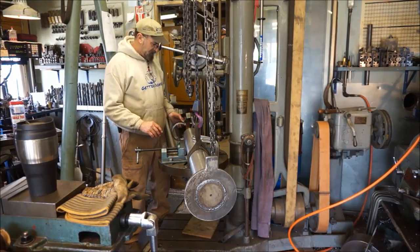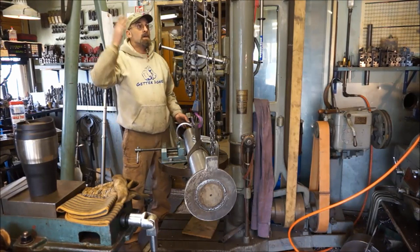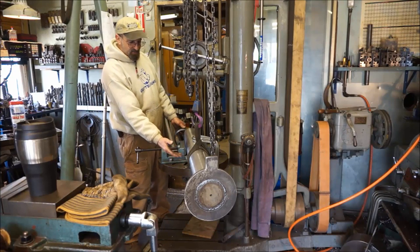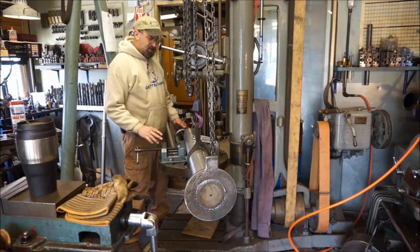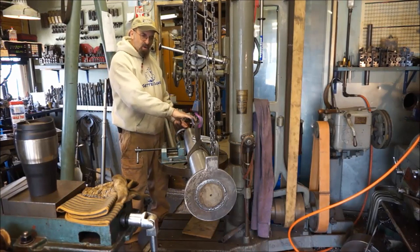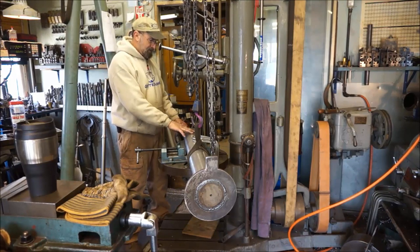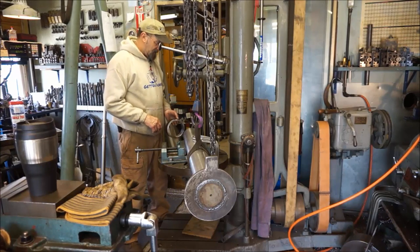Alright, I think we're about ready to get going here. I've got this gantry set up so I can hold this shaft up here. I've got a shim support here and I've got my vise clamped in to hold it from moving anywhere, and this is being held down and held up in that position there. Now we got to put a cross pin hole through our shaft.